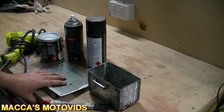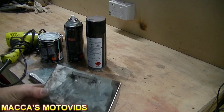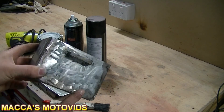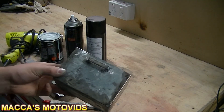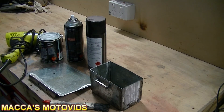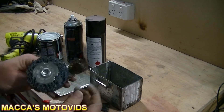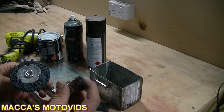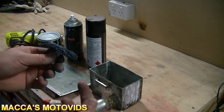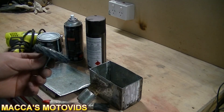What I'm doing today is also what you do for something that's a bit rusty. You can see I've had the grinder on it, grinding back the rusted parts of the steel. You can also use a couple of these items to help get off paint and work your way through the rust, so you're not taking too much material off — all you want to do is take out the rust and leave as much of the good steel there as you can.